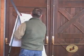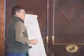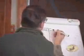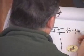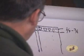And these would be secret dovetailed together so that it wouldn't show from the outside. And that's like the foot of a fall front desk; it would have that kind of a joint in it. A rule of thumb for the length of the tails when you're hand or machine cutting is that it should be between 2/3 and 3/4. The length of them should be 2/3 to 3/4 of the thickness of the face material.